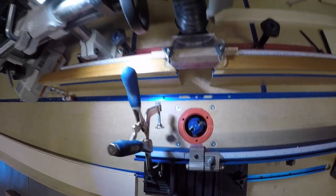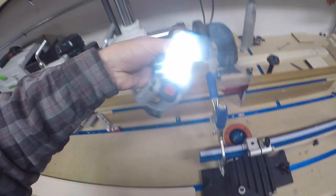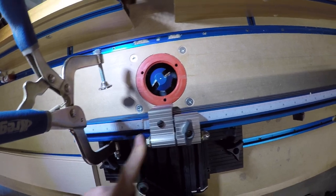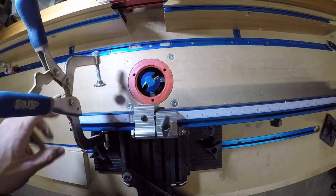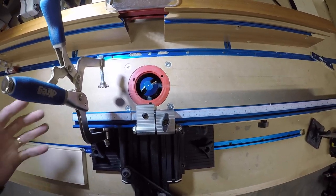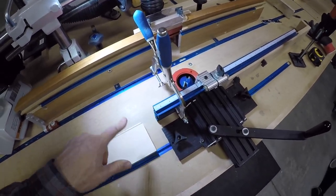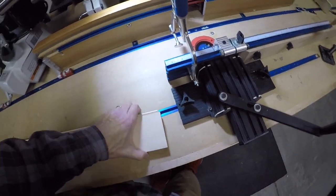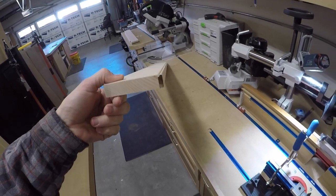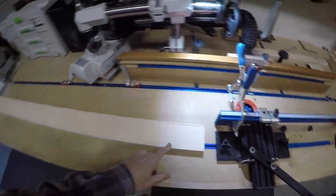It's really nice to have this light up here — this is just one of my magnetic Bosch lights, goes right there. You can see as I'm going down here I have really good vision. These are my lines — they're pretty much like a guide; they're not going to be exact. That's why I do test pieces. I think the hardest part about doing these is getting the setups right and making sure you have straight pieces. If your boards are warped or there's any curvature to them, it's really hard. If you've got bows in your pieces, it really makes it difficult.